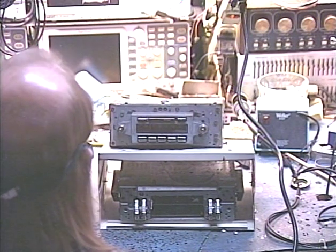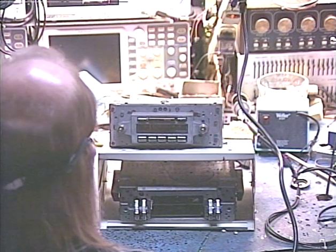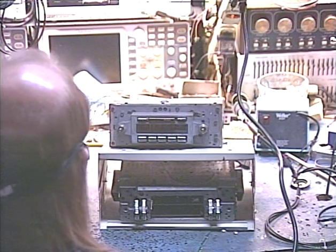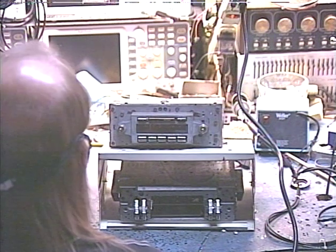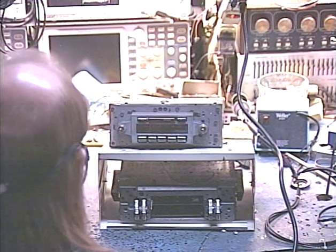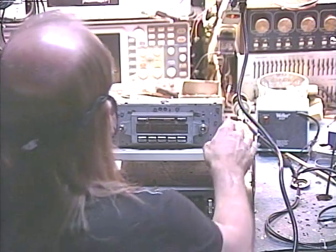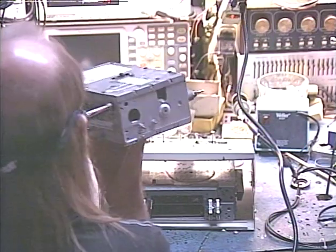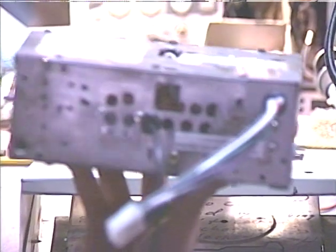The conversion electronics has a lot more fidelity and much more output power than the original, and that tends to really emphasize the motor noise with the old system because the speed control circuit radiates into the preamp circuits and causes all kinds of noise. So this is a full system conversion — it replaces the motor and the tape head preamp with my own hand-built preamp. This customer has also requested the Bluetooth and USB features.